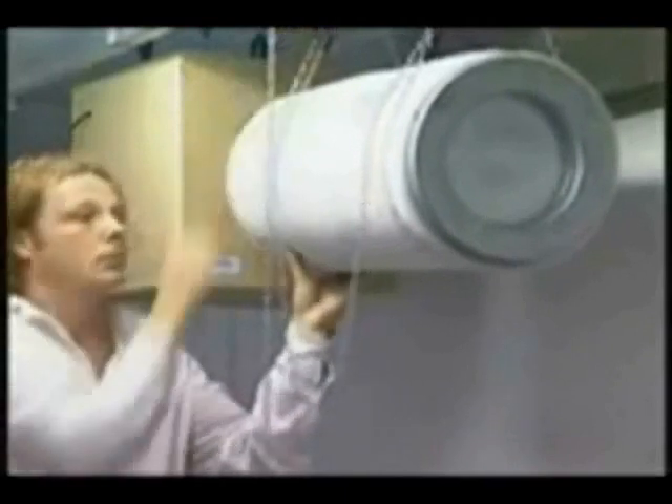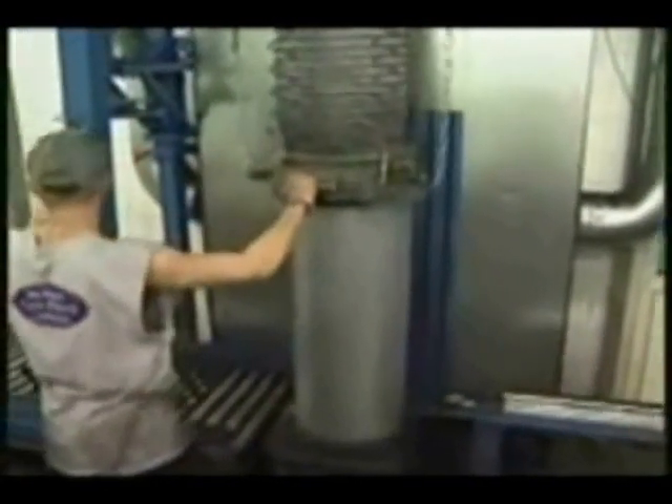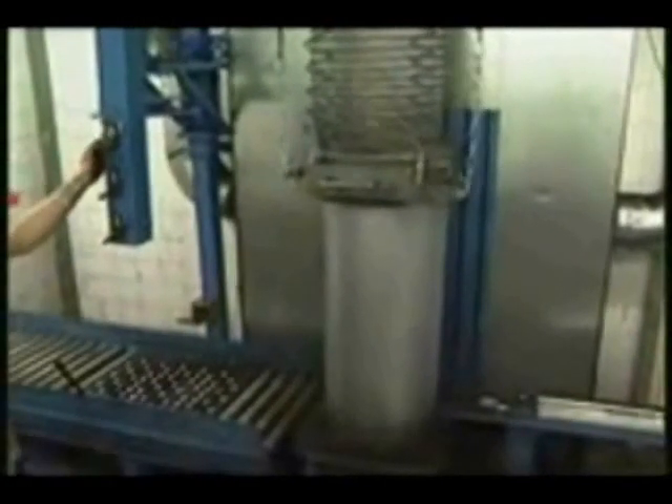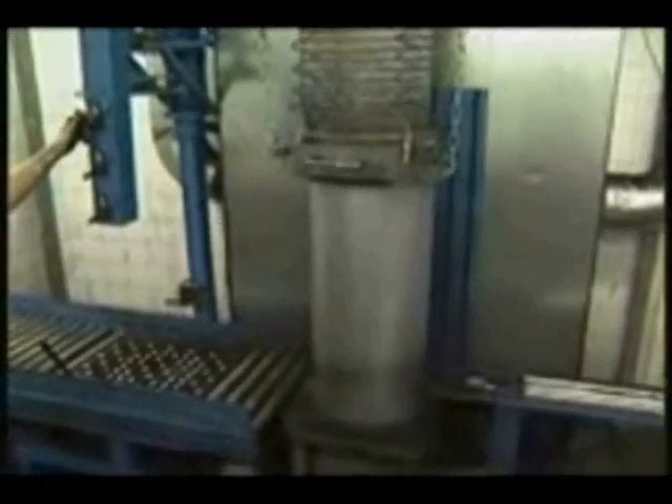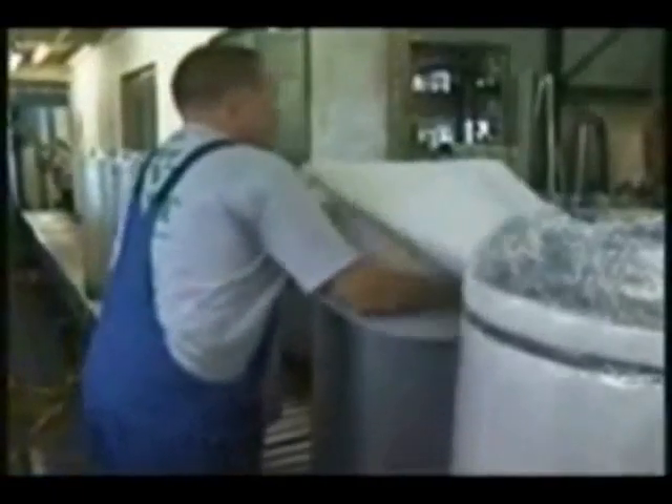The carbon coal filter is connected to the air exhaust. We have chosen a CAN 366 carbon coal filter. CAN carbon coal filters have a large surface area, which allows a lot of air to pass through. Moreover, the air filtering carbon grains are thoroughly vibrated, which increases the density. These qualities guarantee a long working life for the filter. The capacity of the carbon filter and the air outlet pump must be matched — the carbon coal filter must have enough capacity to filter the whole room. We also fix a sound muffler between the external opening and the exhaust air pump.